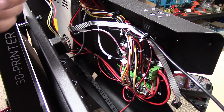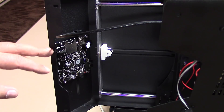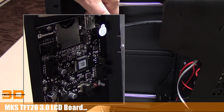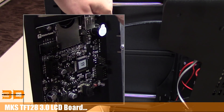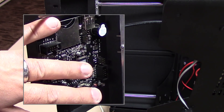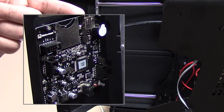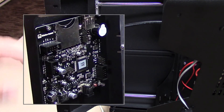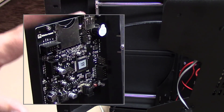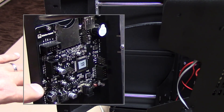This is the back side of the LCD control board. The USB-A port for the thumb drive is actually connected in here, because this board controls things like the filament-out sensor and the transmission of G-code from a thumb drive to the MKS controller. So this system really has functionally two controllers — one that handles the LCD and communication, and another that handles the actual control functions, which is fairly typical but a little more advanced.